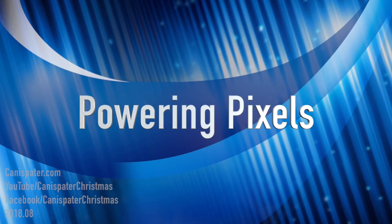Pixels need two things to work: power and data. Every light needs power, so that's not a big deal. Serial data is what tells the pixel the color and brightness you want, and there are computers and software to help you do that. Pixels generally run on 12 volts or 5 volts DC. There are some that run on 24 volts, but the majority are 5 or 12. It doesn't really matter which ones you use — it helps to stick with one voltage. If you mix them, just make sure you connect the strings up to the proper voltage. If you connect 5-volt strings to 12 volts, you'll probably burn them out pretty quickly.